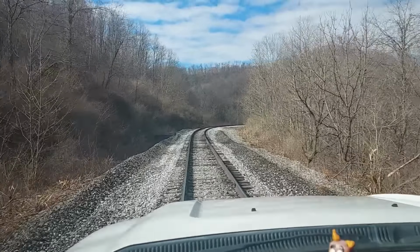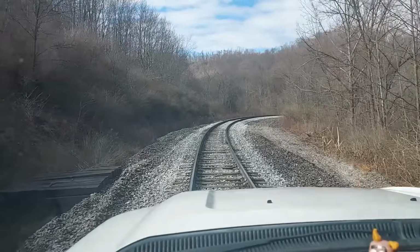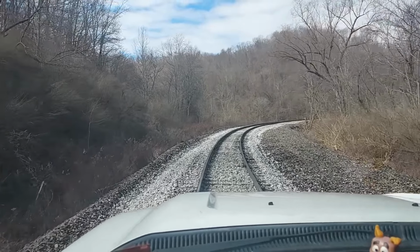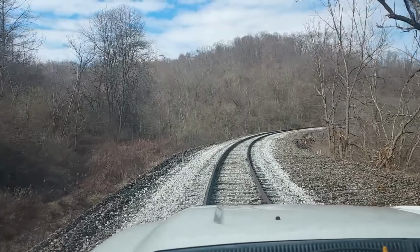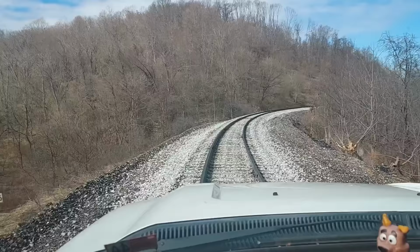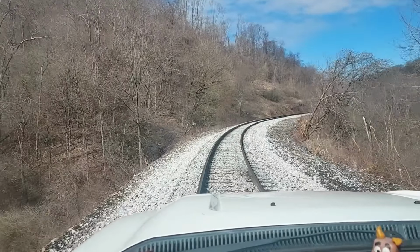We're going to have to bring some more up here and get some rock on the shoulders and some in the center. Tomorrow, we're supposed to get new ballast in. So we'll get rock up here, and I got a couple other spots I got to rock. But I wanted to show you the curve. Looks pretty doggone good. We don't have a lot of heat right now. The ambient temperature is around 40 degrees Fahrenheit today, so I'm not too concerned about the heat pushing the track. Up through here is pretty good. There's a good bit of ballast in here, just a couple spots back there, but we'll get her dumped as soon as we get some new rock in. I'll get this tamped up again after we get some more rock dumped. I got some more stuff to work with.